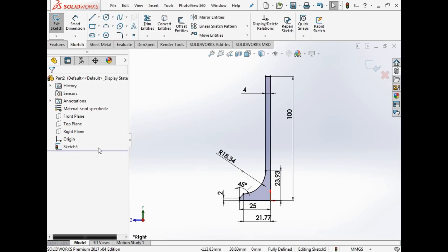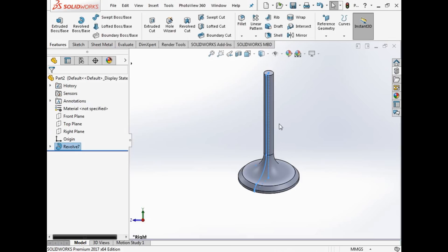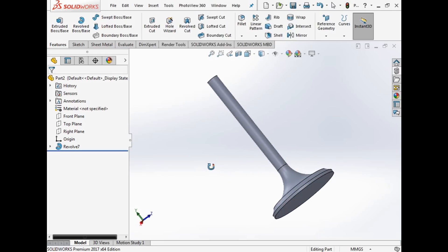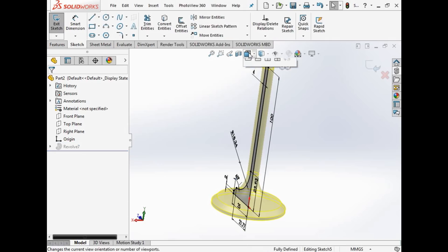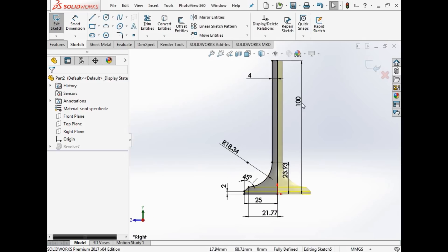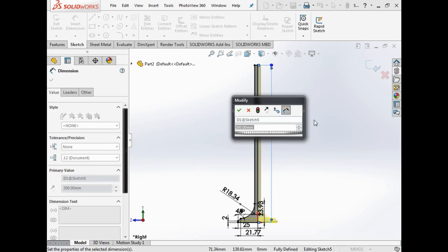You don't always have to manually add a center line — if it's something like a valve, SolidWorks has just picked the axis for us. There you can see you've got a valve. And then you look at it and go: it's not tall enough, it looks nothing like my valve. So you can edit sketch and quite easily just add more length, and it doesn't change the characteristic of the valve at all.